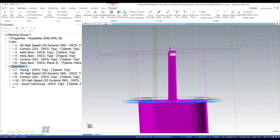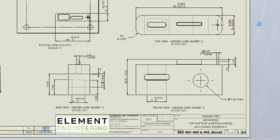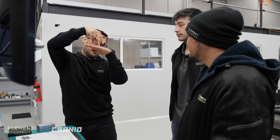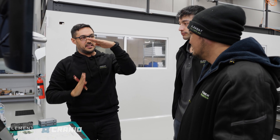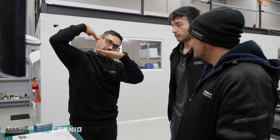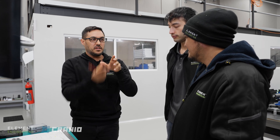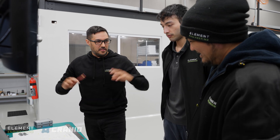You used to be a micro machinist though — this is not quite micro machining, but this kind of setup is still a challenge. Any other challenges with this mould? The slot on the angle — that was the top of the finished face that comes down from the silicone part that had to be basically flat. We couldn't actually get into the mould to angle-finish that pocket, so we came through on the angle to finish that face. The pocket comes through basically straight so we can then put our pin in, which creates the geometry we want. And now we've solved it — that was a three-man job.